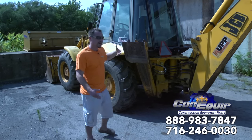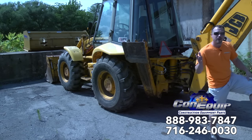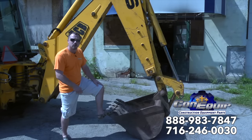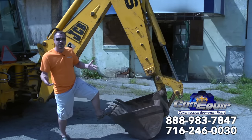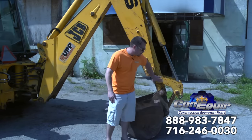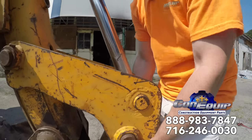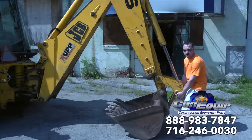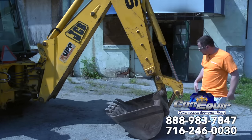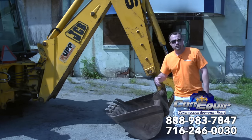The next option would be how many buckets and what size buckets are coming with the backhoe you might buy. Are you going to be digging ditches? You should buy a ditching bucket or see if it comes with it. Maybe you're just doing some backyard drainage and you want a 12-inch or 14-inch bucket. A lot of things come into play. Anytime you see pins and bushings, you just got to wiggle it around a little bit. Just got a little play in there - a little play. It's a used backhoe, it's the things that you look for. Pins and bushings aren't too bad, but overall it just depends on how much money you want to spend versus how much you want to put into it.